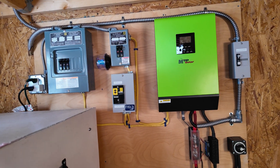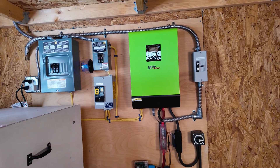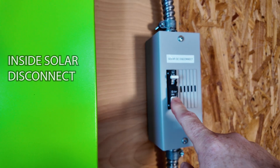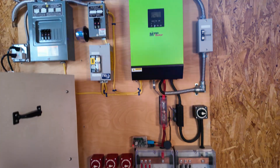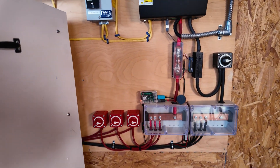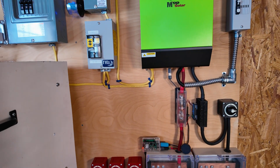Let's go ahead now and take a look at some of the components. Just about everything needs an upgrade here. Also, looking for advice — if you have any suggestions about some of these upgrades, let me know in the comments below. It looks like I'll be taking off most of the components here on the wall. I want to start fresh with a new layout. But there are a couple things I want to keep. I do want to keep this breaker box — I'm just going to put in a single 300 volt rated breaker for the new string. Things will move around to the DC side. I'm thinking about keeping it as is, maybe moving it down a little bit and installing some kind of wireway or gutter to help tie in to the new EG4 6000 XP.